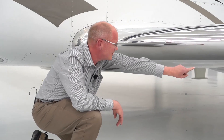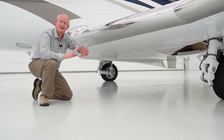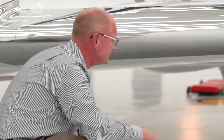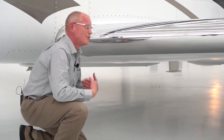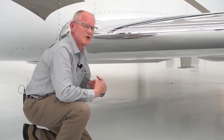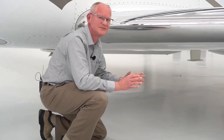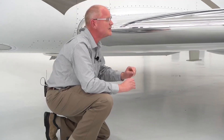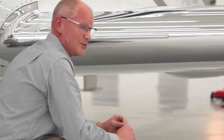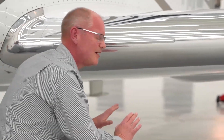Go out and take a look at the landing gear and the gear doors, and make sure there's no corrosion in that area. Then move into the wheel well and check the wheel well spars — both the mid and the aft spar. You'll want to check for CICs and corrosion. There won't be any erosion down there, but check your CICs very carefully, especially around those fasteners, as those collars make it really difficult to spread the CICs evenly. So you want to check that pretty carefully.